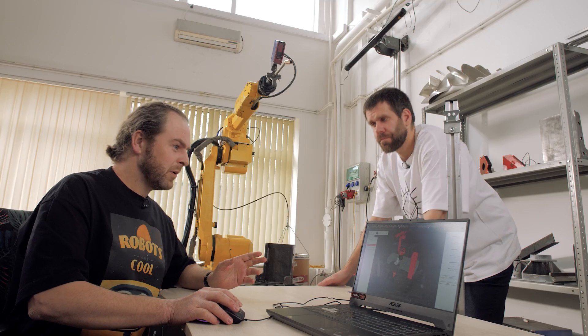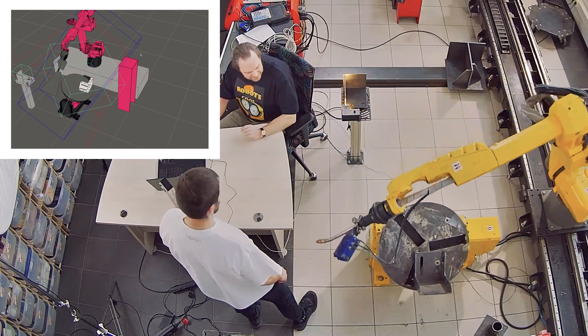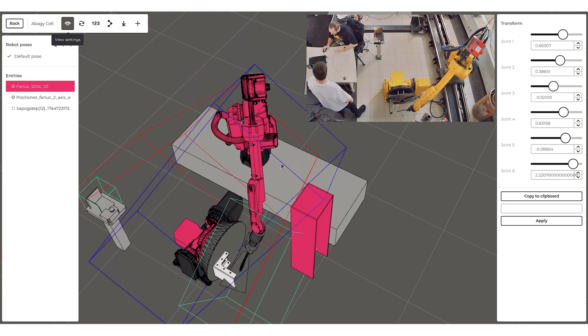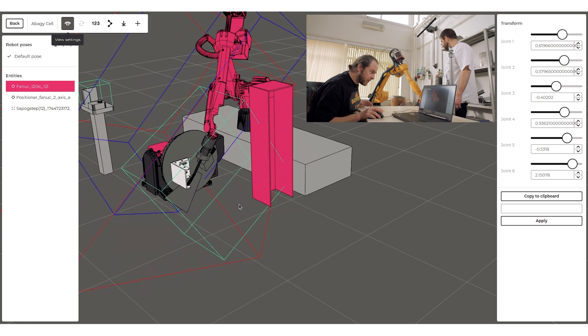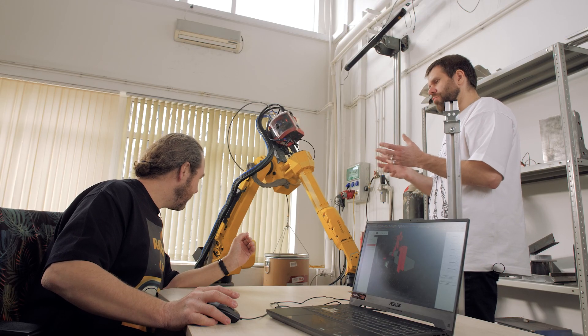It's ready to go. Shall I press the button? Pressing the button now. It still has to think first before movement — like a human. It's in position and it's moving here with corresponding action. It's an absolute twin here — the position is down there, 90 degrees. And it's gyrating now. That's called weaving — it's creating circles around the weld so the metal will be distributed more evenly.